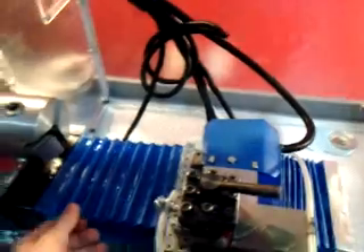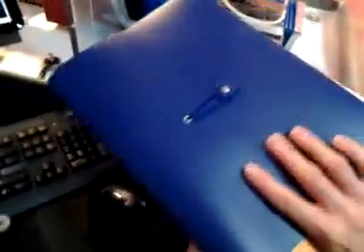So that's about it for the coolant setup. The way covers here I just made out of some plastic folders, kind of like this material here. I just folded them up — it took me about 10 or 15 minutes to measure out the dimensions I needed, cut the material, fold it all up, and then probably about a half an hour to get it all set up on the lathe. But it does a pretty good job and covers everything.